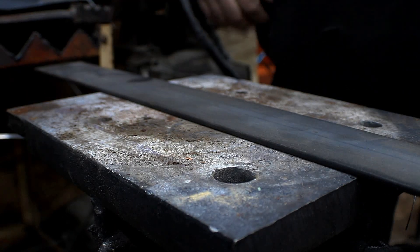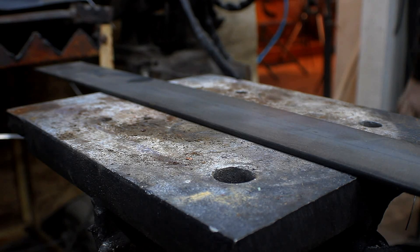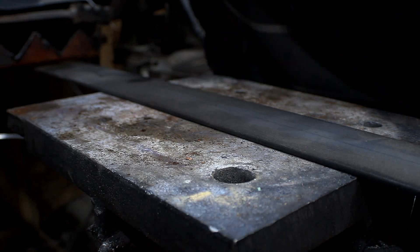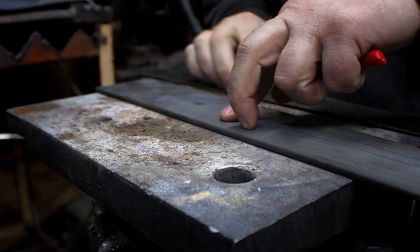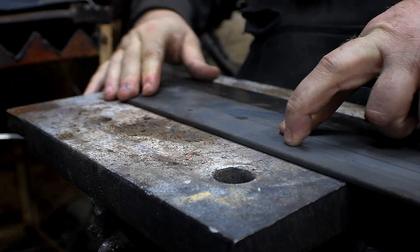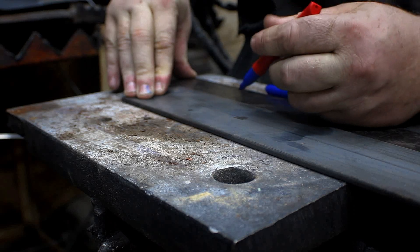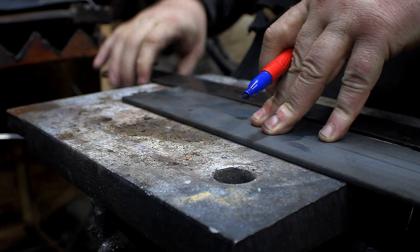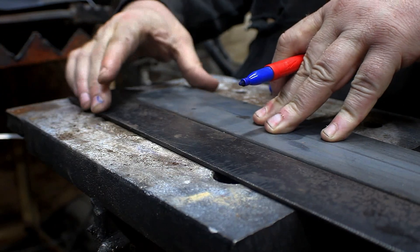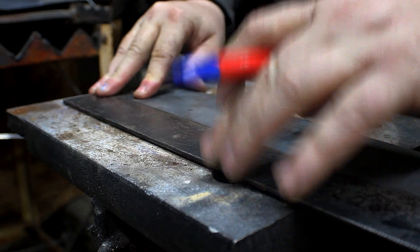All the planning in the world isn't going to prepare you for the weird changes that come down the line. I was looking for material I could turn into boxes for the outside of the forge, and we have this nice 3/16ths by 3 flat bar laying around. Unfortunately it's also the cap material for our canisters, but we'll go buy more later. We're going to be cutting and making 2 boxes, so we need 4 pieces of 4-inch by 3-inch and 4 pieces of 3-inch by 3-inch.